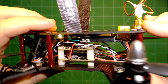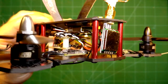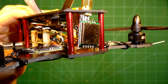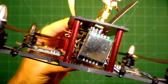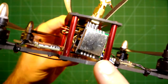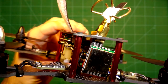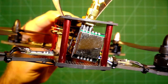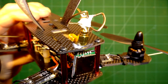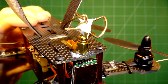So what else do we have here? Here on the bottom we see a regular video transmitter, the EachineVTX. You can get those in both 25 milliwatts and 200 milliwatts, so you can decide what is legal for you. You can see I should have done this better because I had to tilt it a bit to mount it this way because of this standoff here, so I could have done this nicer. But this is glued in, it's very stable, glued in right at this connector. I will see how it holds up. I can assume that maybe the connector might come loose, but so far it works really well. I used some super glue to put that in. Also this antenna here, which I will also link in the description, is completely screwed on, so there is no problem here with the antenna.